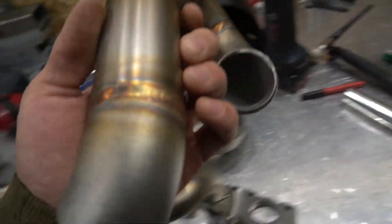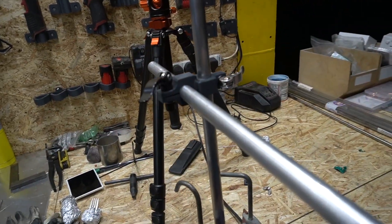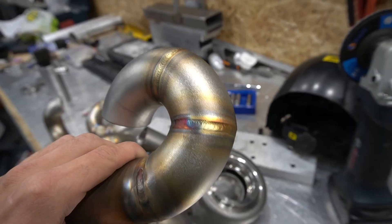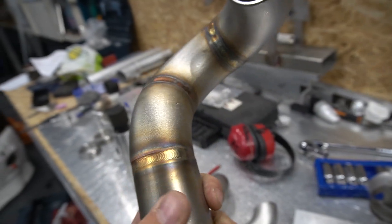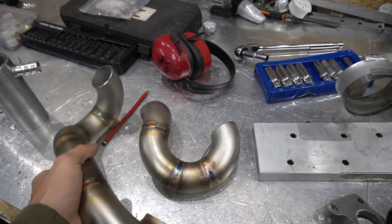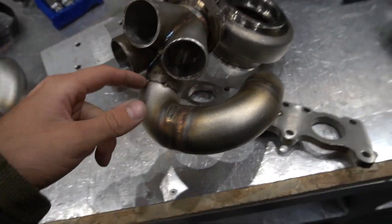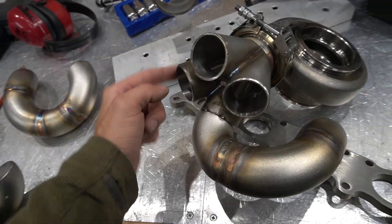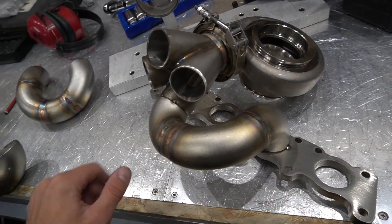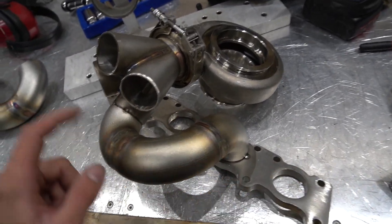Next day — bench is a bit of a mess. This is my positioner that I had set up, and I made some little 3D printed parts just to have a little arm rest so I could get some nice welds, and they turned out phenomenal. It's amazing what being comfortable will do. What I do — and what I'm pretty sure everyone does — is weld everything to the collector first. I'll weld all the way around this and then do whichever runner I want next, and when they're all ready I'll bolt this down to my heat sink and weld all the flange welds together.